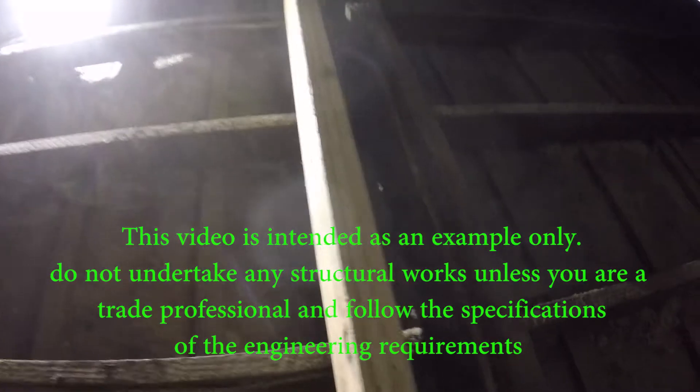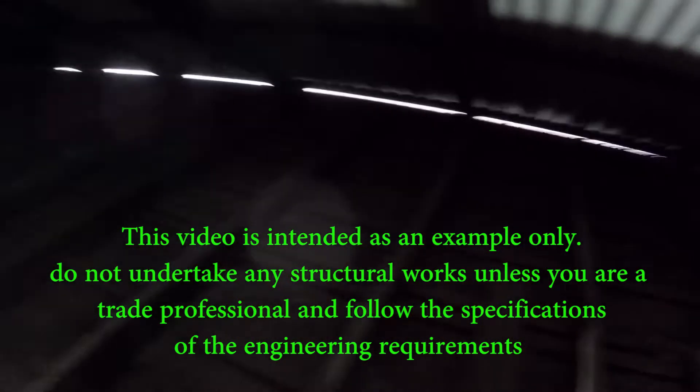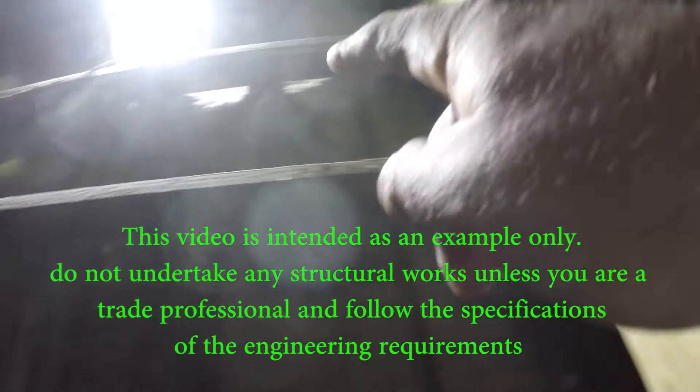Step this way, I'm going to show you an old one and the new one that we're upgrading to. Here we have our hanging beam. This here is our ceiling space and that's our joist that runs all the way through over to that wall plate just there. At the moment we've got this one here which is 25 mil thick and it's 190 deep. It's a piece of Oregon it looks like, it's definitely not hardwood.